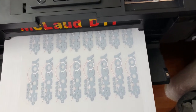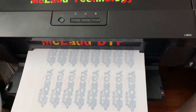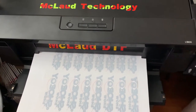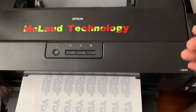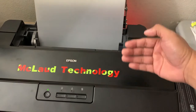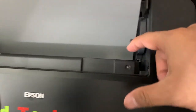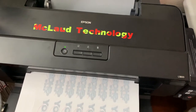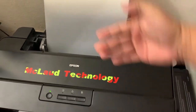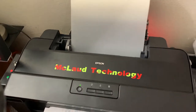Order your printer now because this printer is so much in demand. It's equivalent to a production printer — this is not just a hobby printer. One important thing: stop using sheets. Sheets are only good for home use. If you are in production you should use the roll. Because after printing maybe 20 to 50 sheets, the pickup roller cannot pick up the film anymore. It becomes problematic — it will eat a lot of film and throw it out before it starts printing.